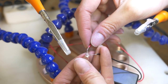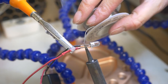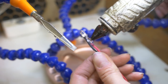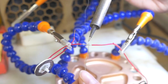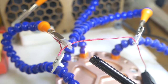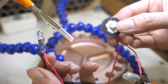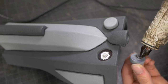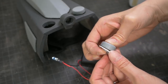The downside to reusing this little LED was the short leads were a pain to solder. I covered the connection with hot glue so it would never move again. The switch was soldered on the positive side before the power went from the battery through the LED. I cut out a little chunk of foam in the button cover and used a little hot glue to attach it to the actual button.